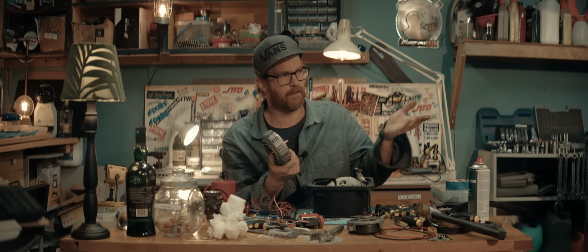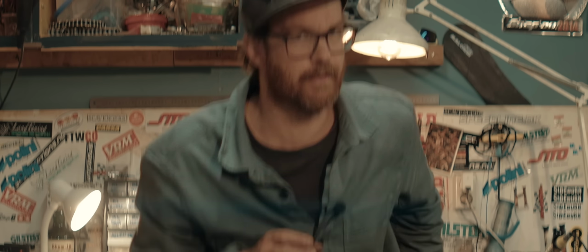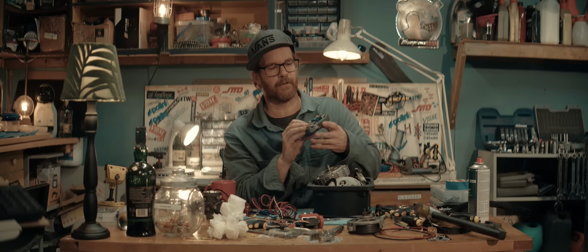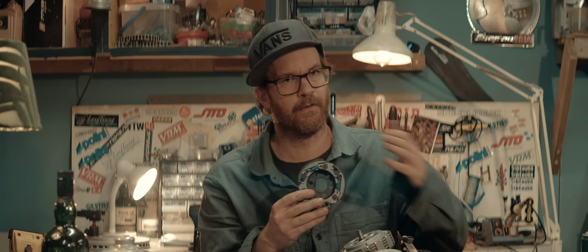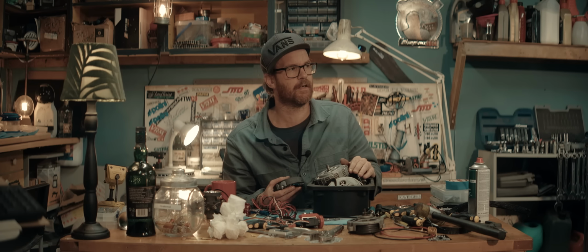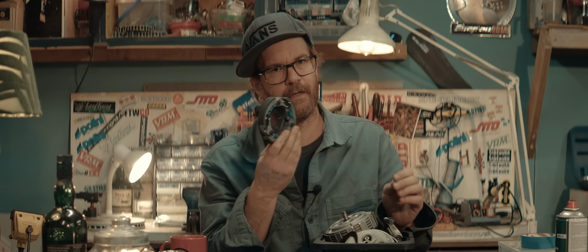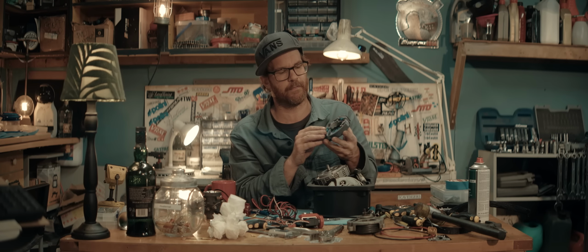What we should do, and probably have to, is mount a clutch to the primary drive of the dyno. There is actually a clutch on there now, but it's locked up intentionally. One of these centrifugal scooter clutches. I could never get it to slip to high enough RPM and lock up enough after that. The problem is the primary ratio. It's a 7.6 to 1, which means if I want this to grab at 7,500 engine RPM, it has to grab at 1000 RPM. They're not designed to grab at such low RPM, it seems.